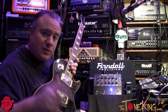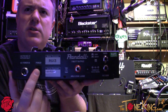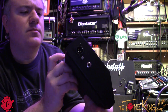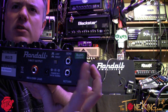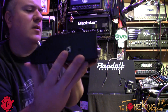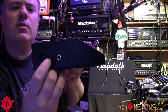There's a lot of circuitry in here — like the XLR route that has cab simulation — that allows it to be as flexible as it is. Let me put the guitar down and show you some of the other features. On the back: this over here is power, your on/off switch. This here is your speaker out — what would go to a cabinet. Next to it, this will power other pedals at 9-volt DC up to 500 milliamps. Then you have your effects send and effects return, and you could also do the loop boost function. On the side: input and stereo media input — two jacks, one for guitar, one for something like an MP3 player. On the other side: balanced out, unbalanced out with a ground lift in case you're getting hum — XLR and quarter inch — and that's your ground lift right there.